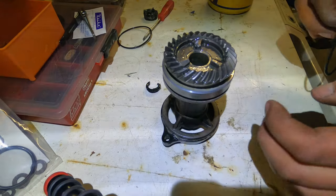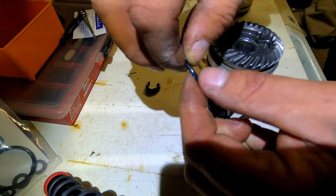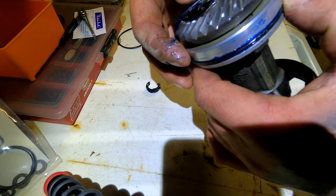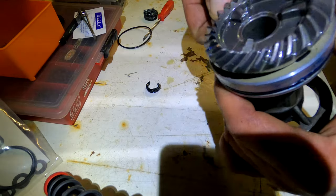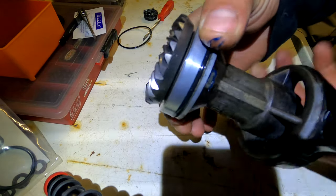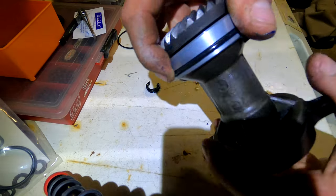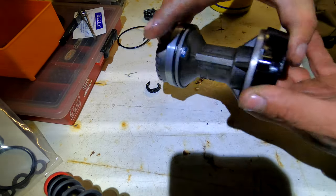The last little job now is to put the o-ring back on. I've put a bit of grease around the whole o-ring to help it slip back into place. When you put it back on, you don't want it twisting on itself — if you just roll it on it's going to start rolling and twisting. So gently stretch it around without rolling it, just like that. There's a bit of grease around it for seating it back in, and I'll put a tiny bit of grease on this face as well — it just saves the rubber getting split when you're putting it back in. And that's it, this is ready to be fitted back onto the bottom.